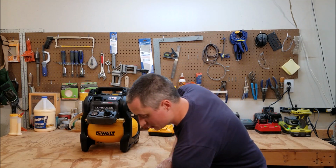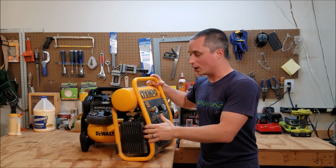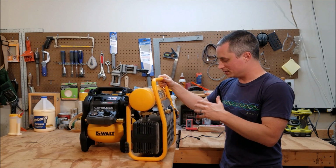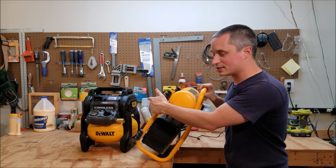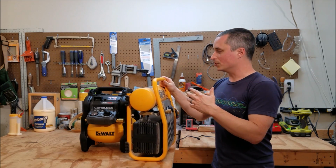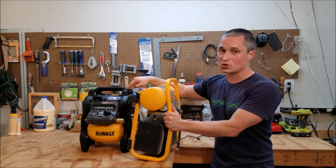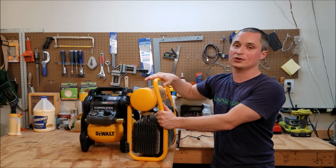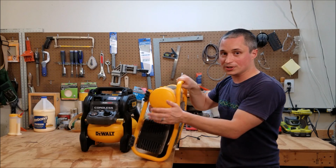And just a quick comparison, I've had this thing for about 5 years now, I think. It's their 1 gallon trim compressor. It retails for about $130 now, I think. And it is a 0.75 CFM, which is significantly less than the 1.2 CFM this one's got at 90 PSI. So for what I'm projecting is probably going to be just another $50, this is a lot more compressor, and it's cordless. If you're looking at the bare tool option, maybe 180 versus 130, and you've got some FlexVolt batteries already, that one's a no-brainer over this one.